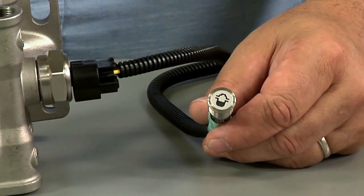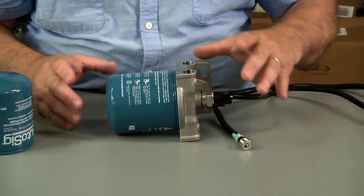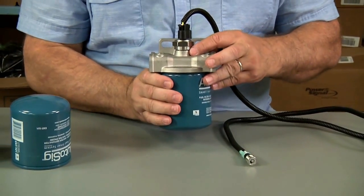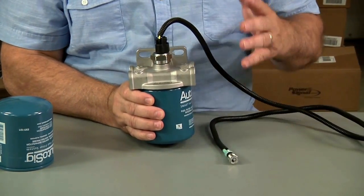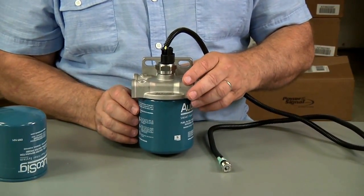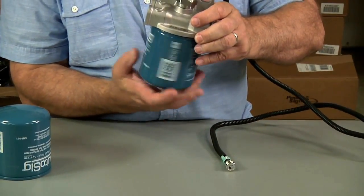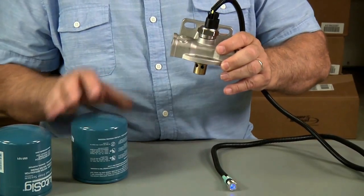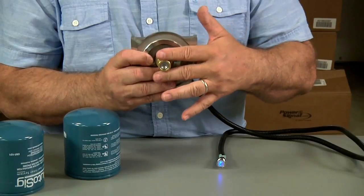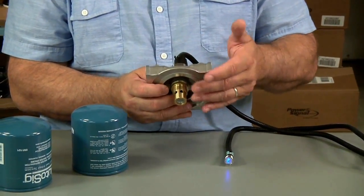If Autosig senses water any time when you're using it, the lamp will come on after a short delay. The short delay is there because you have sloshing of water in the bottom of the filter when the boat's in operation and we don't want it to come on falsely. There's also a self-test: if you do not have the proper filter in place, the light will come on because the touch plug is shorted out onto the ground, which is very similar to the probe sensing water to the can itself.